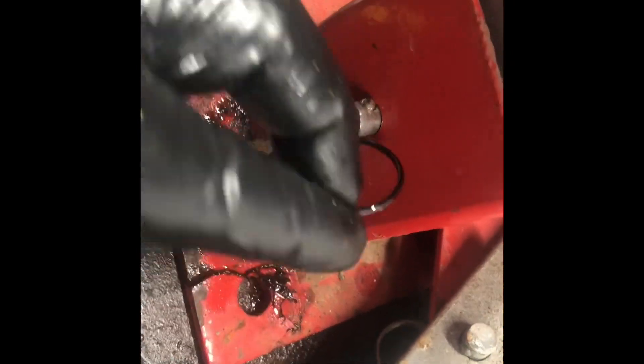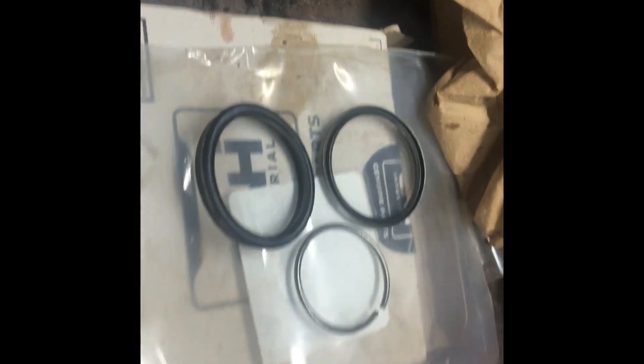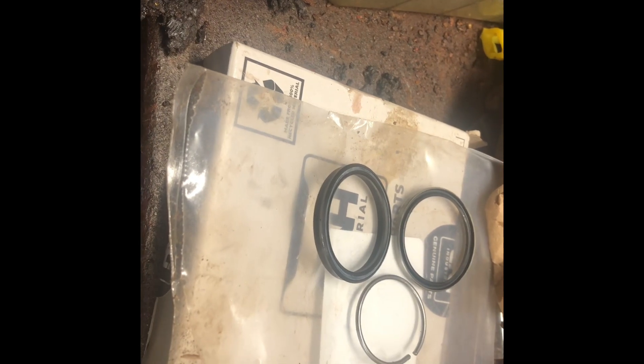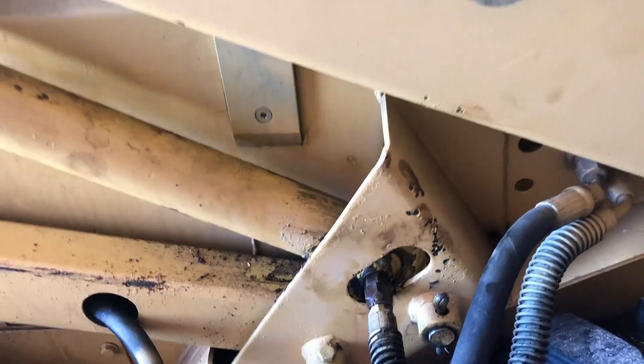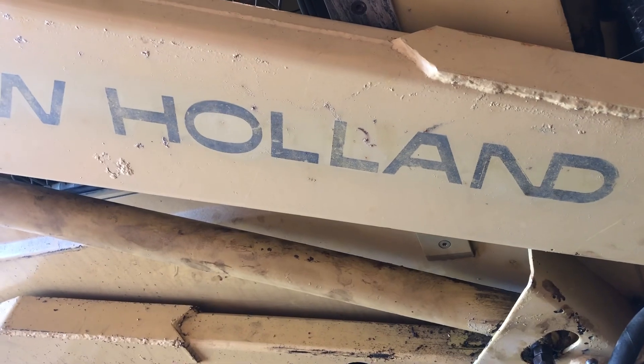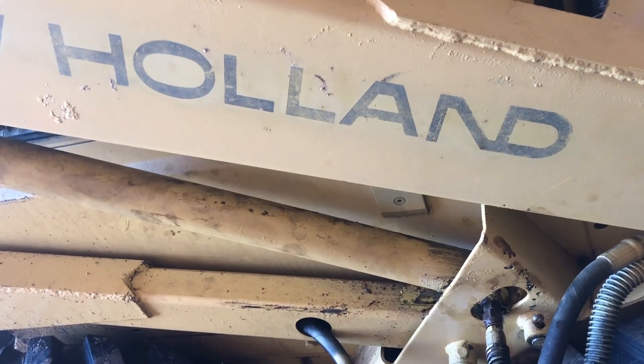The one that goes inside is all rubber, but one little piece is still a circle while the rest of it is all in pieces. I'll put these seals back in, shove the rod in, and then push that snap ring to the shallow groove to lock it in. Hopefully the next video will show it in the machine and not leaking. I got the cylinder back in place — it went back together pretty well. The inner seal fought me a little bit, but I was able to get it in and it looked good.